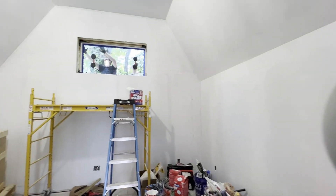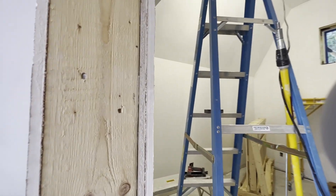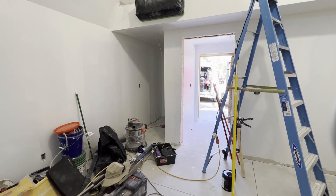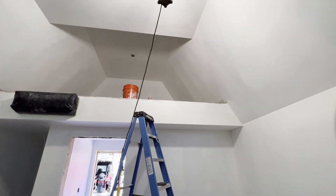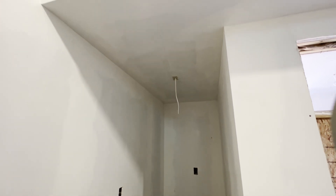There are two layers of drywall on the inside and one layer on the entryway vestibule area. The two layers of drywall attach directly to the hat channels — make sure you don't screw through and hit any wood studs, as that will ruin your entire system. Once the drywall is in place, use acoustic caulk to seal all places where walls meet the floor, in the corners, and where wall and ceiling drywall pieces meet. Then sand and mud your drywall as you normally would.